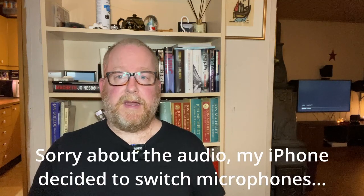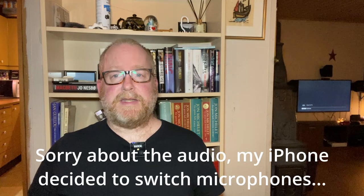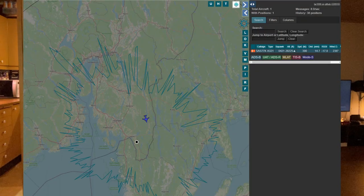Not necessarily the best antenna, but it does work. I use that on my own ADS-B receiver, a completely similar antenna. And it actually picks up pretty good from an inside position. So it's good enough, at least if you want to experiment with ADS-B. If you want to get serious about it, you might want to consider building a collinear antenna. A dipole should work, although I've had better results with a ground plane antenna than a dipole doing this. But it's all up to you. It's all about experimenting. And this little thing, it works. So go ahead, set aside 15-20 minutes and just build it.